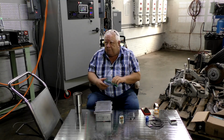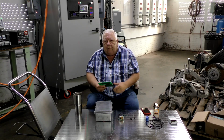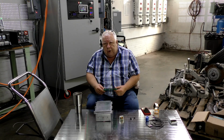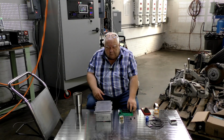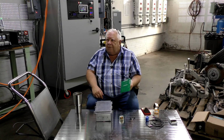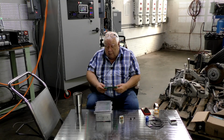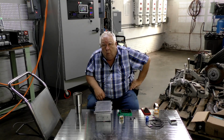And the difference, what we're after: I may not give you the software that runs on the controller, but we will of course publish our communications interface, which can be over CAN or it can be wireless over UDP, and you'll certainly be able to interact with it in other systems, and they don't have to be our systems. We will have this package where it is a power monitoring device that is open in connection. You can get onto it with USB and get data. You can get onto it with CAN bus and get data, wired twisted-pair CAN wiring, or you can simply monitor a UDP port, and you get to configure which UDP port.